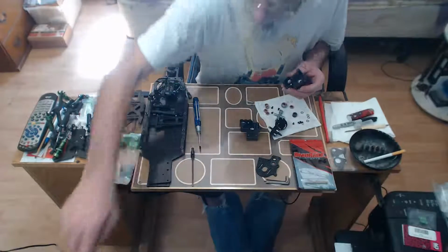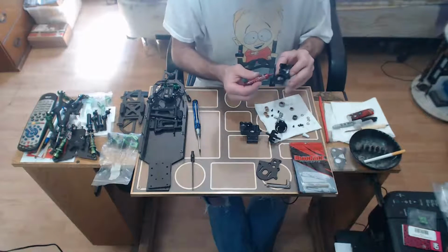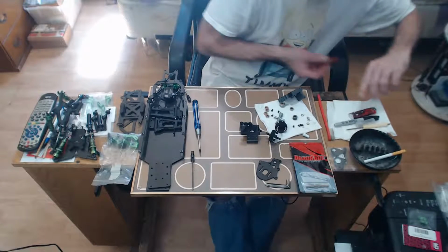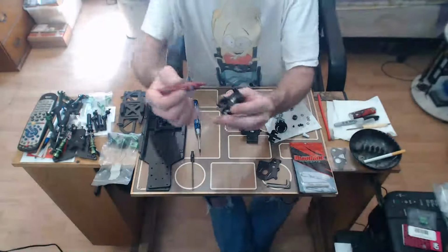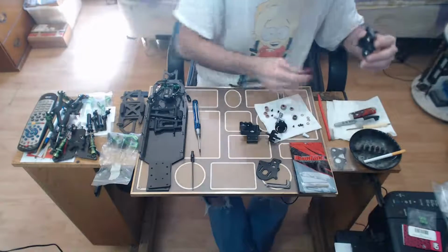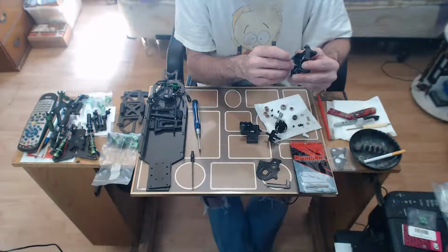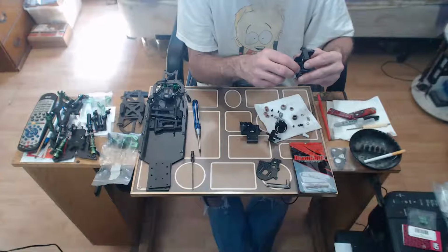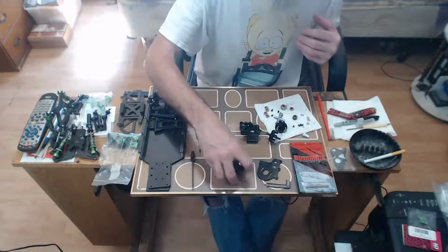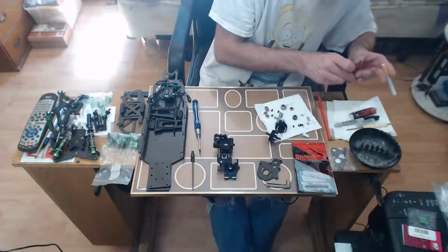One way of doing that, we can go like this. If you ever want to hold something like that, just a small dab, a little dab will do ya. Just clean it up a tad. Put a small little drip right here in the hole for the shaft. Just a smidge. Slide your shaft in. Where's my shaft? Oh, there it is. Give it a spin and then let it set. And that will actually dry up. That stuff will hold that shaft in there. It'll stop flopping around on you. Let her set for a few moments.